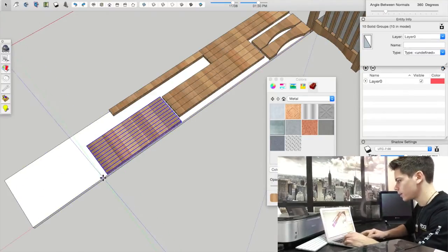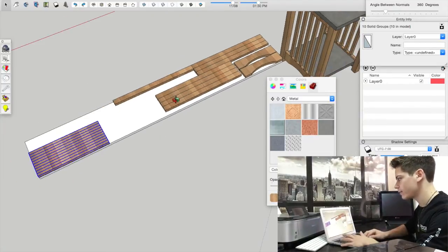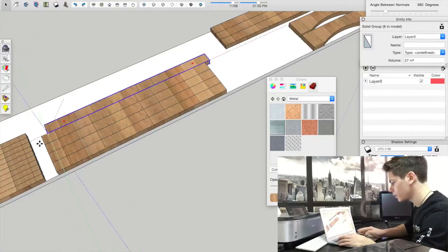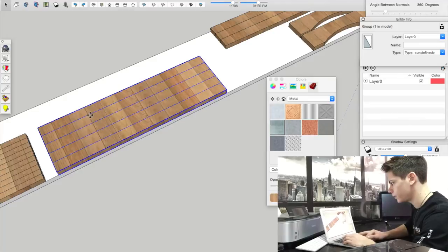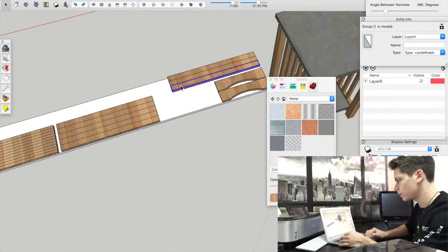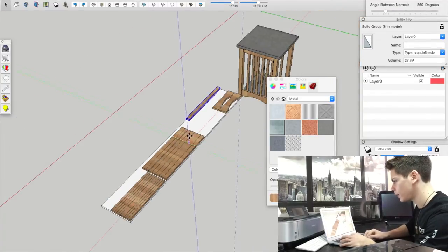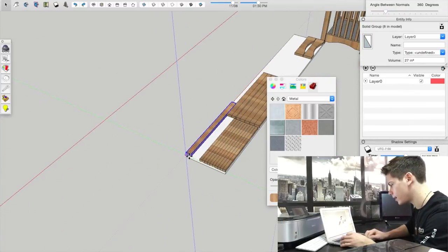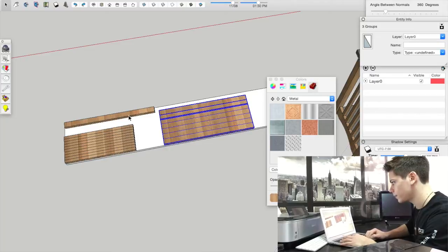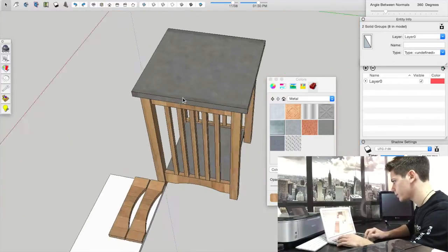A six-footer is more than enough material as long as you cut it right. But if you cut it wrong, you can mess up the material. You really have to plan out where you're going to cut everything. Try to make cross cuts align — one rip should line up with multiple pieces so you're cutting efficiently. This is something you don't have to do, but it gives you the overall concept of how to cut everything to save on material waste.